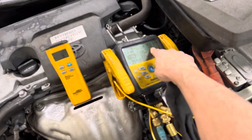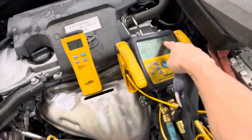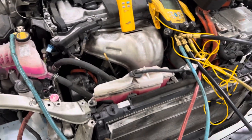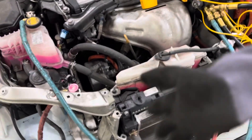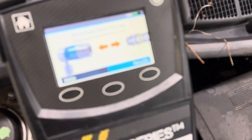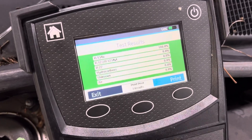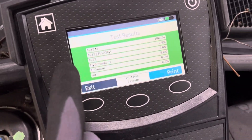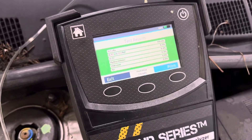As you can see, it's 56 PSI and this is a full system. 56 PSI gives you an idea of what the ambient temperature is here inside this space. Our test is almost complete. We can see our results now — we are 100% pure on R-134a, no air, just pure refrigerant.